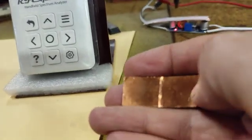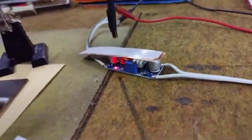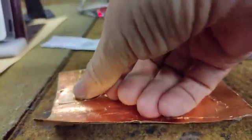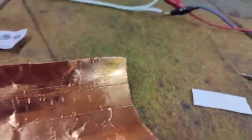It has got a glue at the bottom, so you can actually glue it like I have done over here, make it into strips like I have done over there. I can peel off here and glue it to whatever unit I want to shield. Now that glue underneath is actually conductive glue, so if I remove this paper and glue it on top of this, it will make electrical and physical contact with the copper or material below. So it's very easy to apply, fully conductive from both sides, and very thin, very easy to operate.